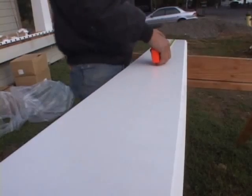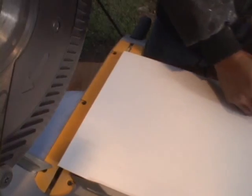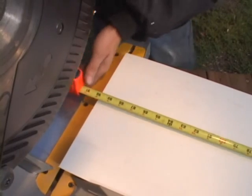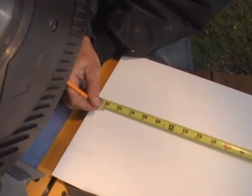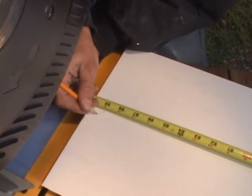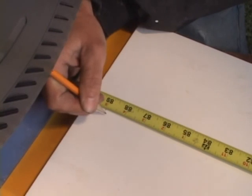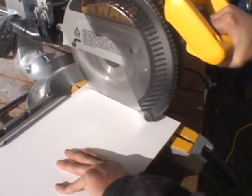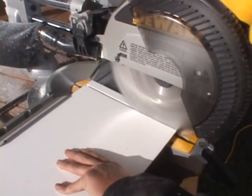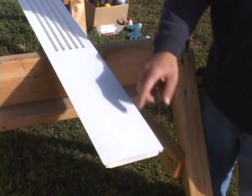Next, take the shaft pieces and trim them 2 1/4 inches shorter than your opening. This allows 2 inches total for the cap and base and 1/4 inch for expansion. If you are not using the cap and base, only cut off 1/4 inch from the shaft piece, as the cap and base are 1 inch each. Always trim from the bottom only. The top is marked. This is only for the tapered columns with standard caps and bases.